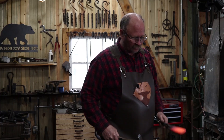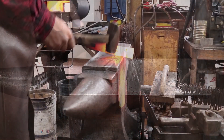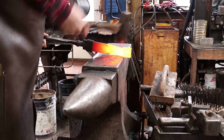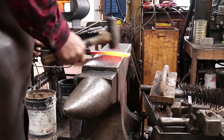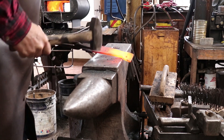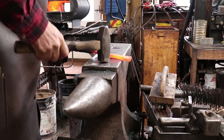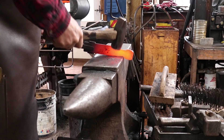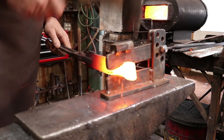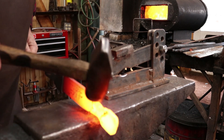I want to start by isolating the mass. I just line it up at the edge of the anvil and try to keep my hammer and my anvil edge lined up. This is going to need a pretty big neck in it. So if you don't have any fullers to do this job, that works quite well. But if you have a fullering jig or some other fullering option — a smithing magician, guillotine tool type thing — it can actually make this a little easier on you.